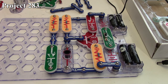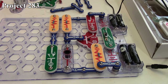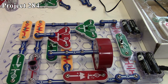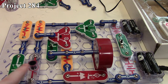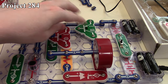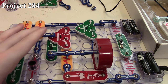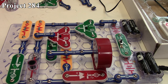Project 284 is the mail notifying electronic bell. There it is in the book and here it is on the board. Now we're going back to 6 volts with two batteries. We've got a similar setup with our photoresistor and green LED, where the green LED stays constant. Our NPN and PNP transistors are coupled together with output going to our speaker and LED. We have our C2 capacitor connected to the base of our NPN, creating a resonant frequency that we hear from our speaker which acts as our electronic bell.